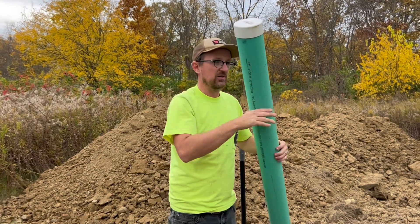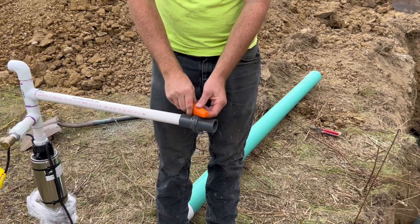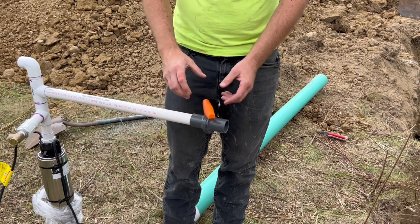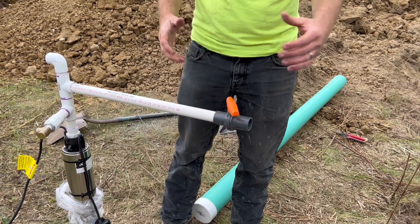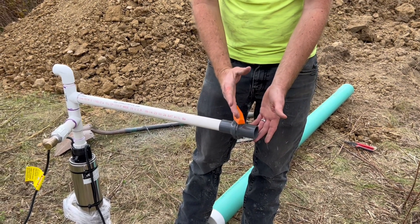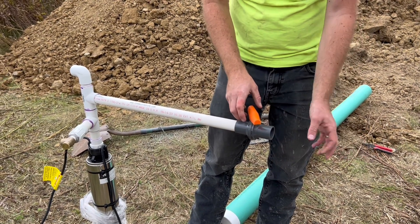With the valve box open, we're giving the customer a water key that he can use to turn this valve. The goal here is not to have the valve fully open or fully closed, but to have a throttling option. Because he's not using much pressure or much flow for his drip irrigation, we want to give that excess pressure and excess flow a place to go. We don't want to rely on the pressure relief valve — that's just here for emergencies. So we're going to leave this valve about a quarter of the way open, so the pump is primarily supplying the drip irrigation system, but there's a blowout path for that excess pressure and excess flow.